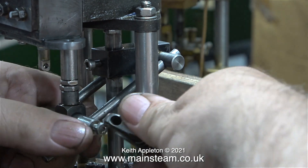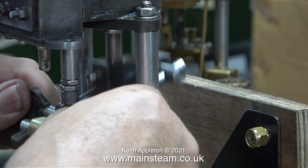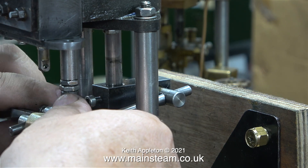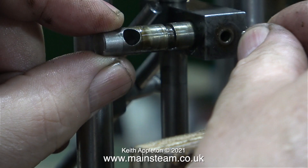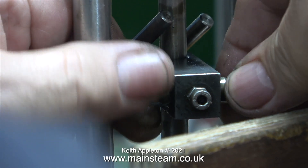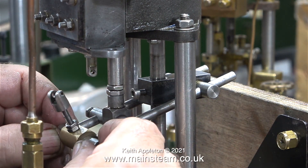Here I've applied my spanner to the fulcrum — this is the only place where the two drive bars need to be locked in position. If I was rebuilding this pump, or if I built this pump from the beginning, I would have used phosphor bronze bushes on all the moving parts. This is steel against steel, never a good idea. The part of the shaft that goes through the block connected to the piston has a groove in the middle, and an allen bolt with a specially shaped end stops this from moving around. This part must be free to rotate. The whole thing feels so much better now.